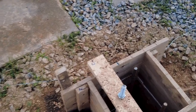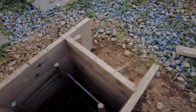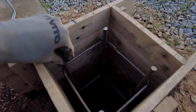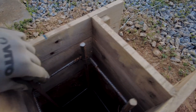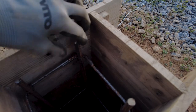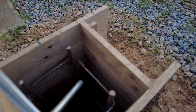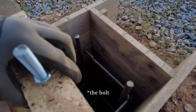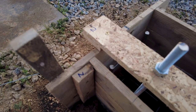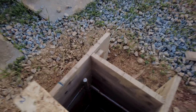We have all the forms ready for concrete. I'm not quite happy with the distance between the rebar and the end of the wall — we ordered the forms to be a couple of cm smaller but the order was wrong and we didn't want to wait any longer. We still have a couple of cm, but 3.5 cm would be better. We're going to pour the concrete slowly, make sure the rebar is sitting in the center, and once the concrete is set we're going to put the screw in. I've already marked the location of the template and we're going to leave it waiting for the concrete to harden.